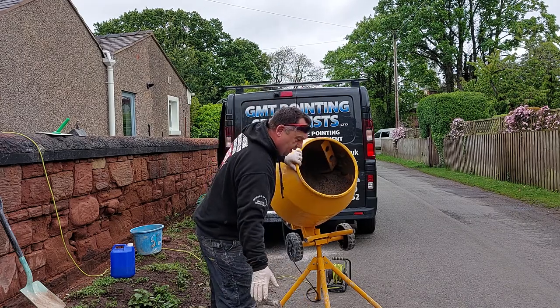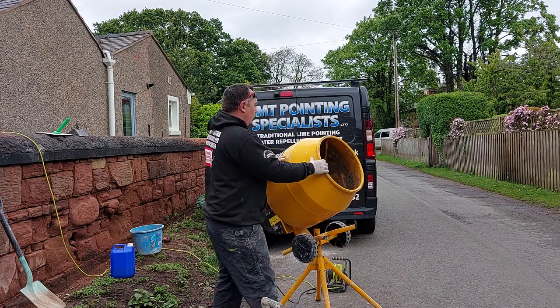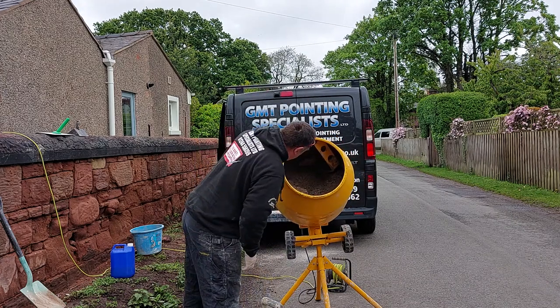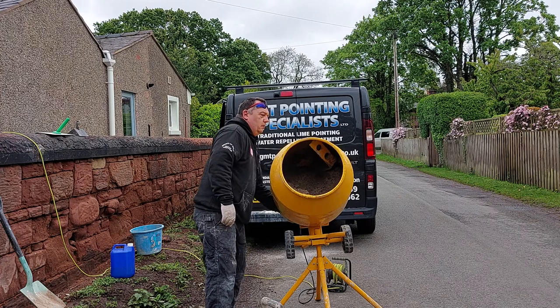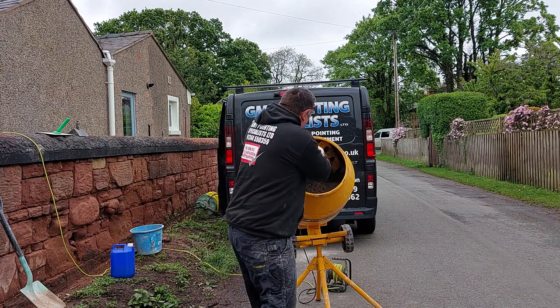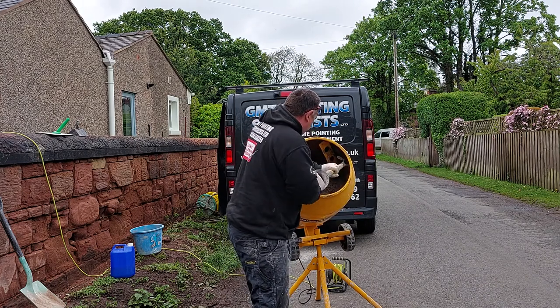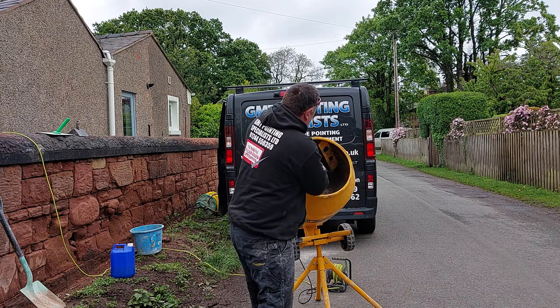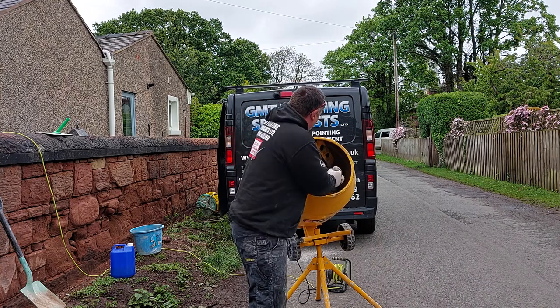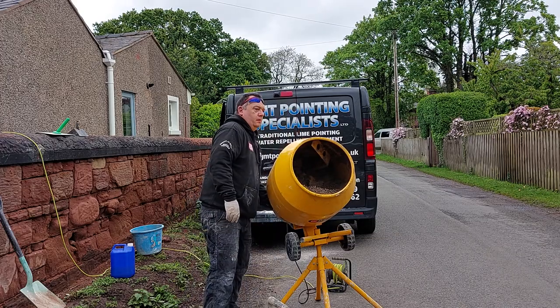You'll know when your mix is starting to get good, because it's going to start sticking to the side of your mixer. You know that's when that's a very good mix. Just spin your mixer halfway until everything comes forward. And then mix it again.